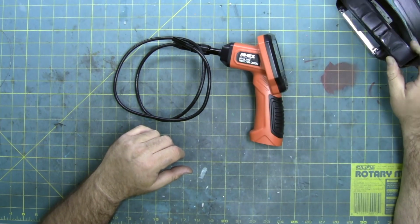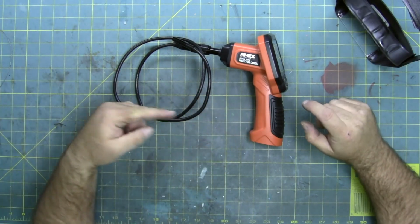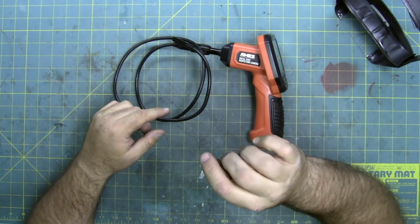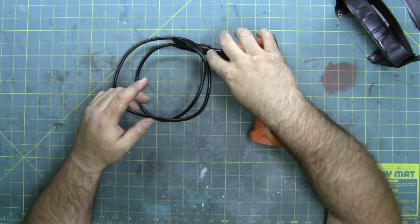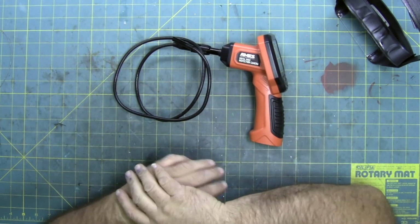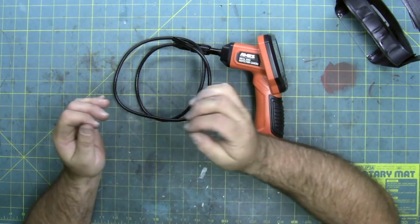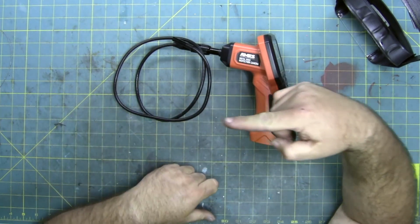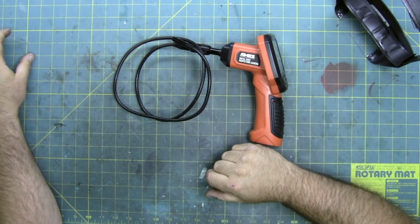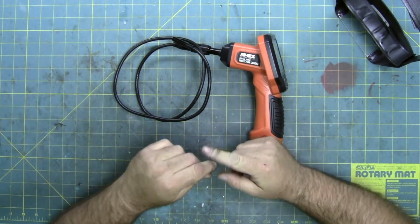And I had to cut a slightly longer pin and then solder it and then push it back through. And then once I pushed it through to the height I wanted, I used the bulb of solder to rest up against the plastic base, and then I coated it in Gorilla Glue. I didn't want to use hot glue because hot glue flexes, and if you push it in, it could push it through. Gorilla Glue, once it hardens, is rigid. Same with most super glue, crazy glue, etc.